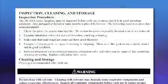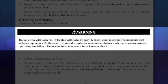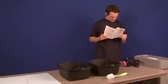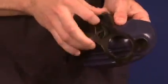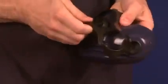The manufacturer's procedures should always be checked to see if certain cleaners or disinfectants might damage the respirator and should not be used. If this is the case, the manufacturer's instructions must be followed. In general, cleaning and disinfecting consists of taking the respirator apart, washing it, disinfecting it, thoroughly rinsing it, and putting it back together when it is dry.